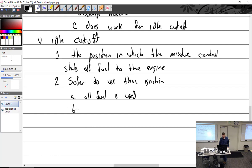All right, and let me see. We'll put this one. Three: allows the mechanic, because us dumb pilots don't know, to check idle mix. Every time you pull off the mix, turn it off, look over at the RPM and say, oh, it went up about 50. If it goes up more than 50, you're too rich. If it didn't go up 50, then it's too lean. Now, if it's too lean, that is not your indication to go out and make it richer. You have to ask yourself, if it was set up correctly and it was getting a 50 RPM rise and now it's not, why isn't it? More often than not, it's because you have a leak somewhere and now it's running lean. So you have to look for the leak. All right, break time. When you say leak, that's like an air leak? Air leak.